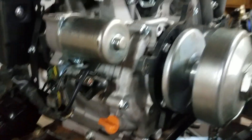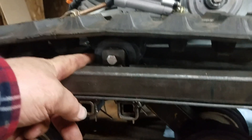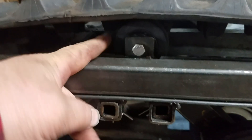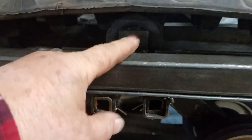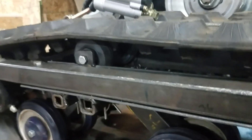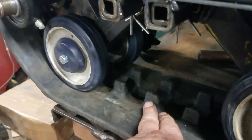I can see myself putting a battery right in here somewhere, and that'll be cool. I got my idler bogey wheels on the top — two sets on the top there. From surpluscenter.com: two inch diameter, one inch thick, five-sixteenths inch bore. There's five inches in between my frame rails there, with the wheels and the distance between the track lugs down here. Everything fits perfectly.